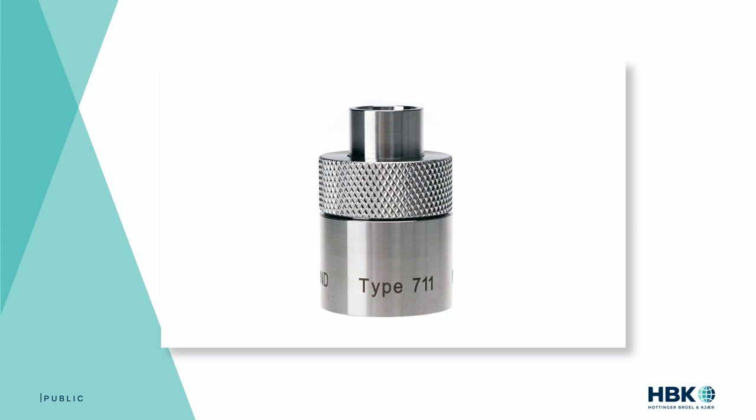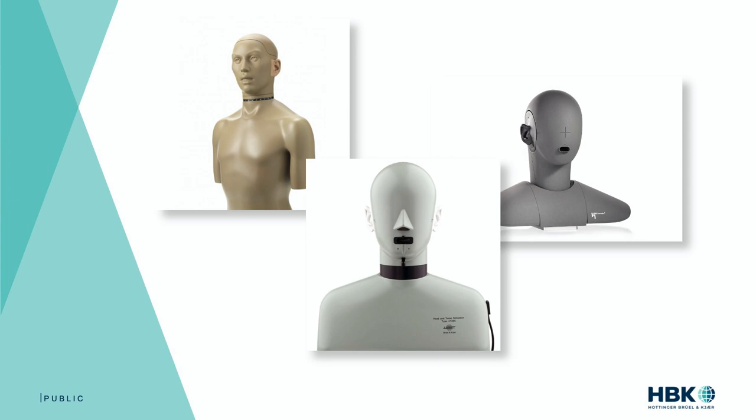Something else that can lead to measurement uncertainty and inconsistency with 7-11 is the variety of 7-11-based measurement fixture configurations available. One of the most popular and simplest configurations involves a simple metal canal extension attached to the 7-11 simulator for measurements of insert devices. There are also full 7-11-based mannequin setups by different manufacturers and configurations in between. While this flexibility can be helpful functionally and in terms of budget, it can also contribute to seemingly arbitrary variations in measurement results. When these inconsistencies arise, it becomes quite a challenge trying to correlate the measurement we're looking at with the device as we hear it. This disparity between a headphone's measurements as we see them versus its sound as we hear it is, in my opinion, one of the critical issues we face when measuring headphones.